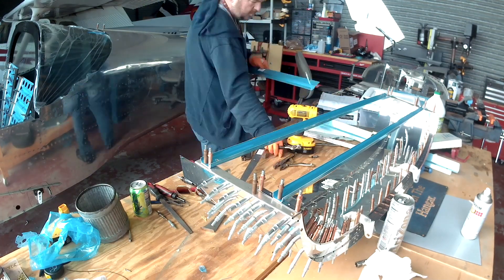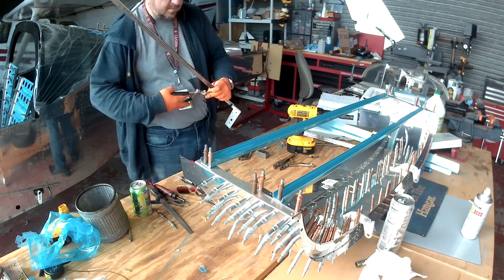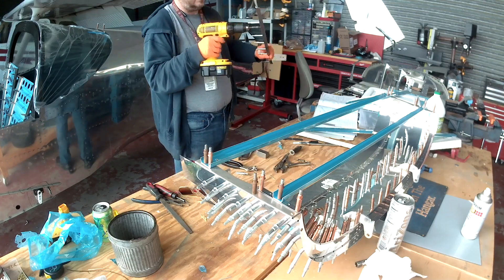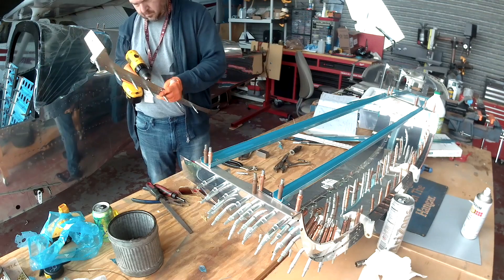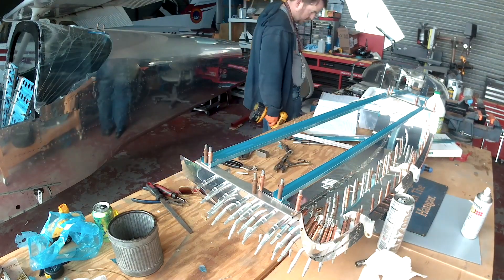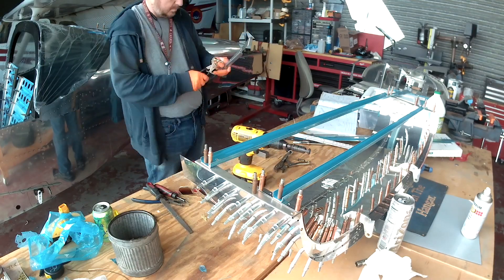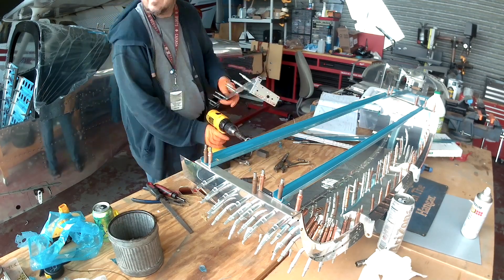Quick Q&A: Paul asks why I'm incorporating ground feedback wiring in all my components. Ground loops — I'm not going to go deep into that, but let's just say you want to avoid them. You don't want static and interference through your radios. Avoid ground loops, and also consider EMI with wire bundling.